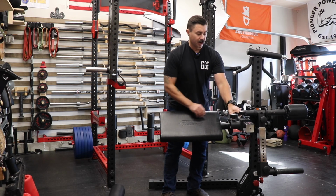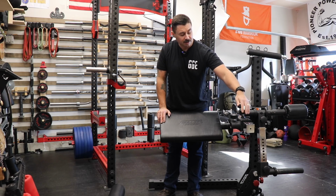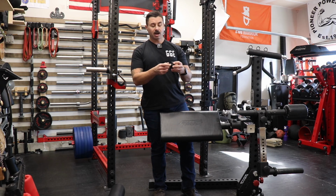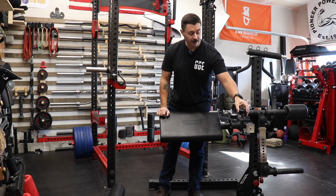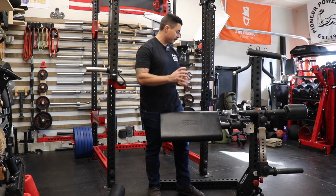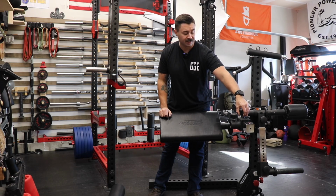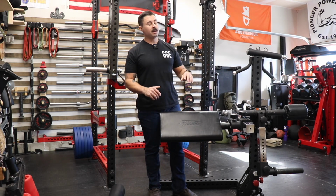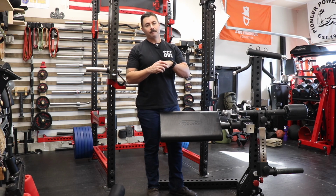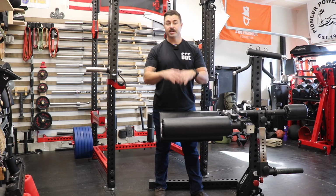The other pop pins on this unit honestly leave a little bit to be desired. These are a standard plastic handled pop pin that have the ability to come in and out, rotate, and also apply tension. That tension allows it to not move around. My main issue comes in with some of these grinding up. As you use them more and more, you can grind on those plastic gears, especially if you anticipate tightening it before it actually gets all the way seated, and as a result, you can grind some out. Now, with that critique being said, I have yet to encounter any pop pins that don't work. I just know that there's some where as I tighten it down, it grinds a little bit. So that's it for the attachment arm.